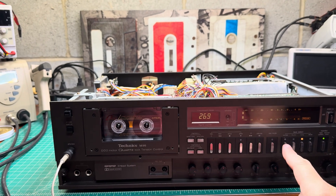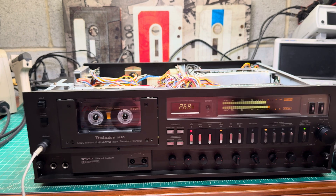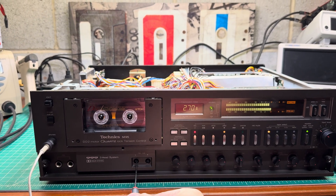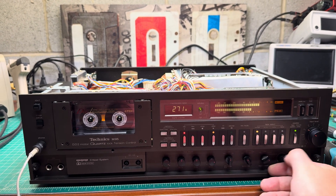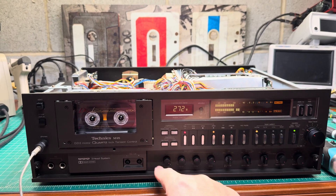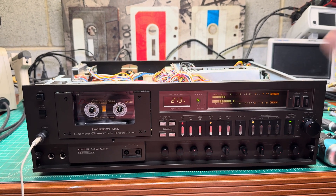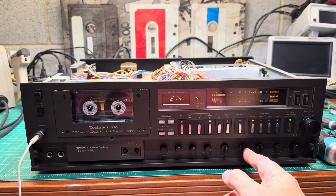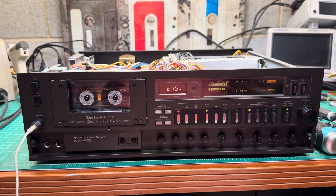Done — bias in place, very good. Distinguishing source and tape is very hard on this deck. The principle is: set the level so if you're recording on the same tapes you don't even need to open this cover — unless you need to use Dolby, because the Dolby switch is right here inside the cover. I wish they had put it somewhere outside.